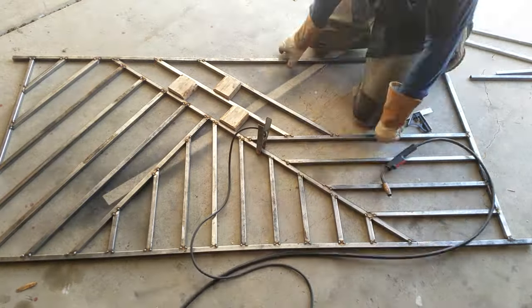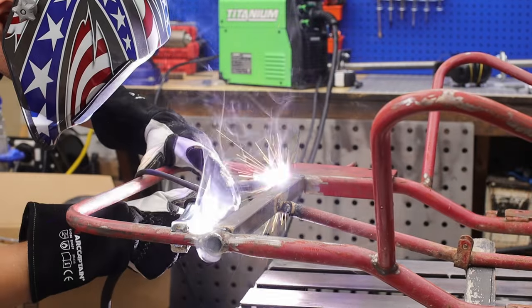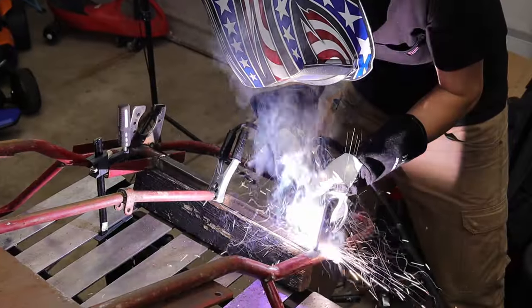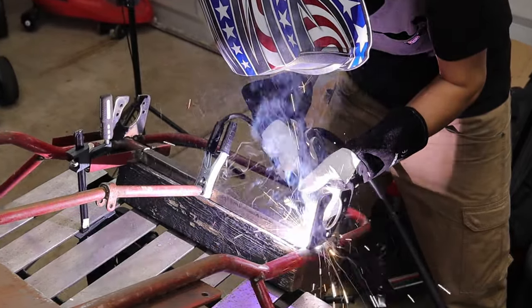By far the most common project and shape I did would be with square tubing. I love it — I use it for all kinds of stuff. I did numerous railings. If you never find the exact shape needed, for example going from one-inch square tubing to one-inch round tubing, you can make it work — you'll just be practicing filling some gaps. Another example is this 3/16" bearing plate going down to the frame of that round tubing — still no issues, turned out great. The settings I used were about E and 6.